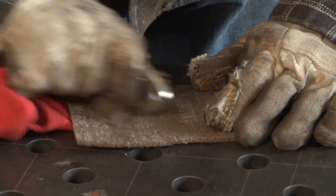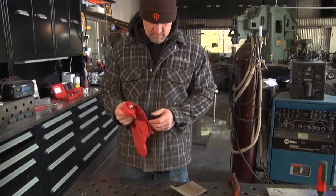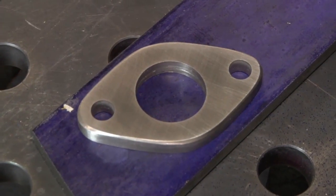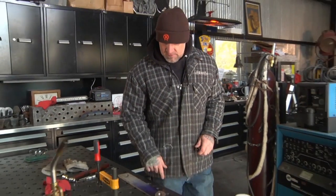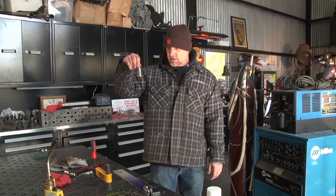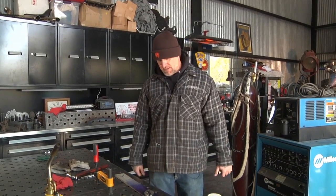So that's that. I'm pretty fast at that type of stuff, but you could apply this kind of technique for making stuff, it's pretty simple. I think the hardest thing about this is having that rotary broach setup. We could have drilled the stud holes easy, but having that big, perfect 1 3/8 hole, and having a cutter that'll cut it precisely, fast, without some crazy machine shop operation, that's it right there.